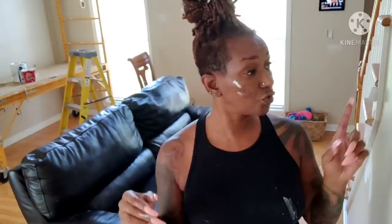Then the painting part can start and we won't have to worry about going up top painting, paint dripping down, because I have drippings on the wall now, which doesn't matter because it's going to get painted anyway. So that's why I'm up at the top painting it, getting a smooth white complete finish on the top, all the way around. Again, the same thing is going to happen at the bottom. So start at the top, get it bright white, whatever color you choose. Then you work on your wall, so you don't have to worry about dripping from the top part. And then just paint it down.